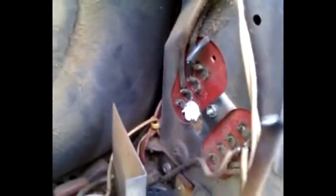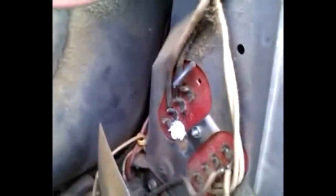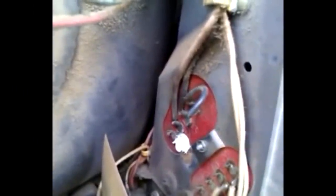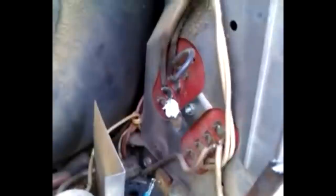You can see this burnt area here, where this lead has been arcing. This is the lead that comes up from the damper to the flyback, so that's got some huge high voltage pulses on it. Right here is the plate cap wire for the horizontal output — I'm going to replace that because it's all corroded. I scraped all the cigarette crust off and cleaned this up real good. I actually had a hole in the fiberglass backing to the flyback, so I filled it up with a little silicone. I'm going to replace this wire and the plate cap wire and try this cigarette-encrusted Sylvania out.